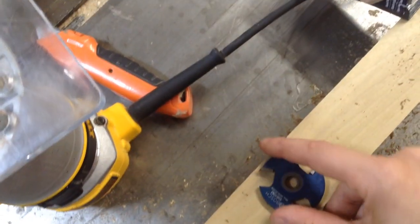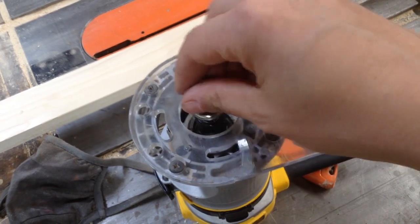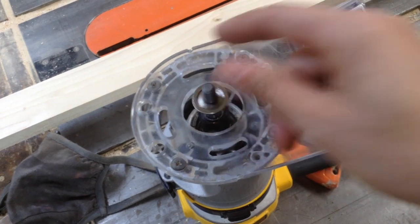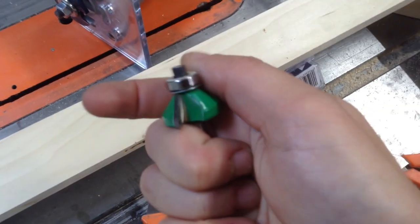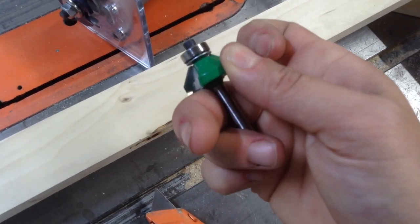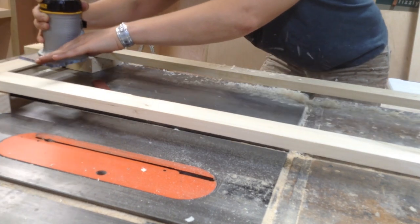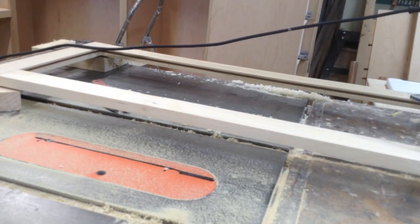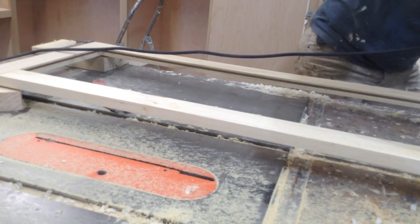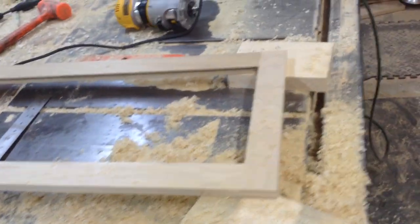I had a cheaper bit that was burning the edges, so I found this slot cutter - you buy the arbor and slot cutter separately. This is not a sponsored post; if anything I don't particularly love these Bosch router bits as I've had problems with the bearings overheating and blowing out, but I was in a bind and these were what was available nearby. This one doesn't have a movable bearing - it just has a larger silver washer as the contact point against the wood. It's a three-blade slot cutter so it cuts pretty quickly, and I did enjoy the way it worked. I could cut the whole slot and then cut my panel as well.